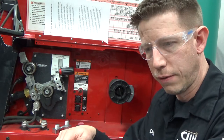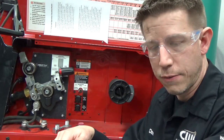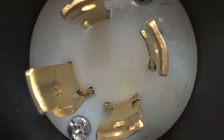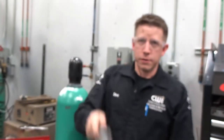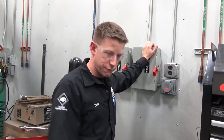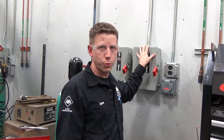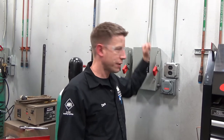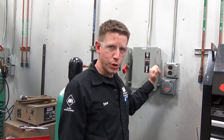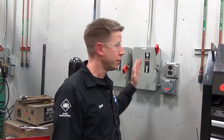So we're talking safety. Let's begin with inspection of the machine before we even turn the power on. A good place to start is at the power cord and the power source we're going to be tapping into. What we're going to be using is a lot of electricity to create the electric arc that's going to melt our base metal and filler material. This power source here — don't open it. All you need to know is down is off and up is on. Best practice is to stand to the side, turn your head away, and turn it on. Also, keep the area clear so you can get to it quickly to shut it off.